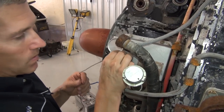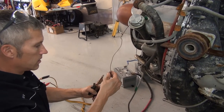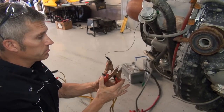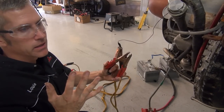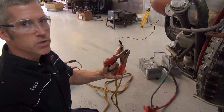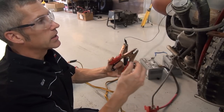Very good, and all I'll have to do is just wire these up. I'm working on a wiring panel or gauge cluster for it, just to have everything sort of neat and tidy. I've got an oil pressure gauge, I've got an EGT, exhaust gas temperature. You gotta have that or you'll melt the motor down. This thing doesn't really run any hotter than what you would think. At the back where the business end is, if you exceed 700 degrees Celsius for an extended period of time, a few seconds, you're probably going to really start to melt your engine down. But probably at cruise, maybe 500-600, probably mid 500s. That's about it. Okay, let's see if this other one goes.